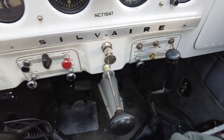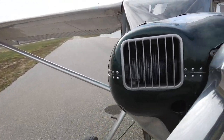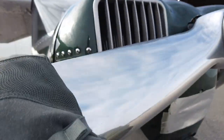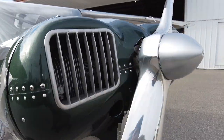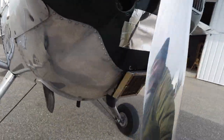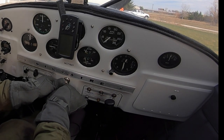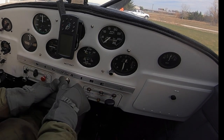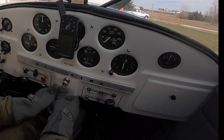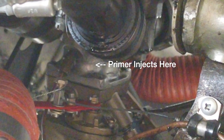We're going to make throttle all the way back, turn on fuel. So we turn the prop manually by hand, and we've got to do it slowly. With the throttle being closed, the cylinders create a vacuum — a suction — which draws fuel out of the idle port in the carburetor and primes those cylinder heads with fuel. One, two, three. Keep in mind, this is just spraying it right underneath the intake — this isn't actually spraying fuel in the cylinders.